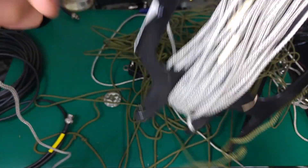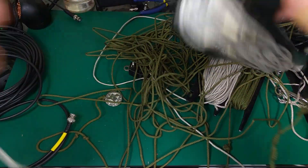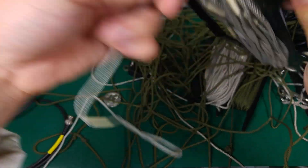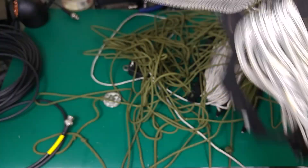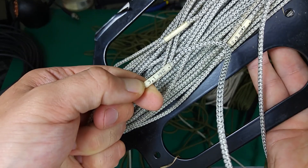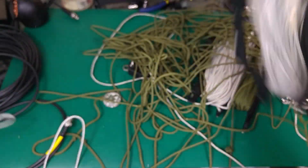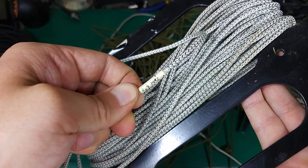As you can see, you can tune it quite nicely even down to 4 MHz. Of course, as I told you at the beginning, you don't have to worry that those are the only frequencies you can operate — you can pick any frequency in between, any length, just by looking at your SWR. We've got 3.1 MHz, then 3 MHz. Are we going to drop to 2 MHz? Let's see — 2.9 MHz.